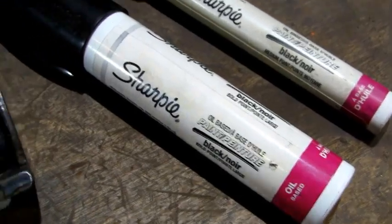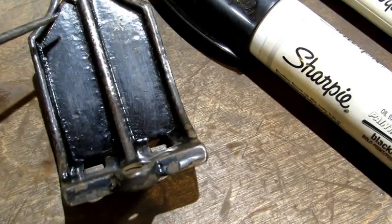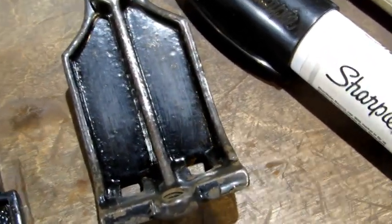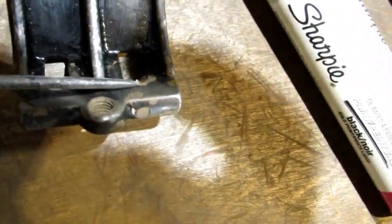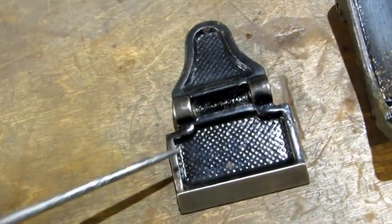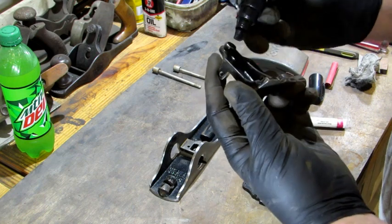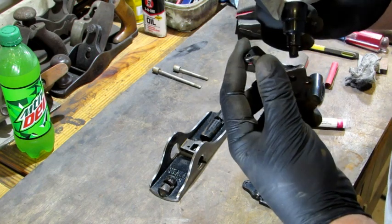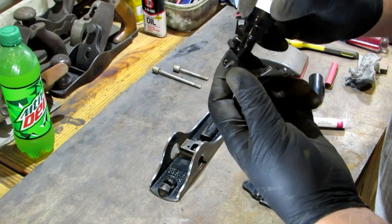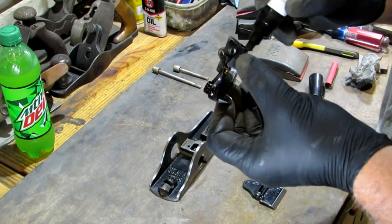What I'm going to do now is use my oil pens to touch up the leading edges around the edge of the frog where there's Japaning loss, a couple little spots on the inside of the bottom, and a couple tiny little spots on the lever cap. I do this primarily just to seal the edges of where the Japaning has broke off, with the hope that it will help prevent any future loss. I look at this as more of a preservation step than a restoration.